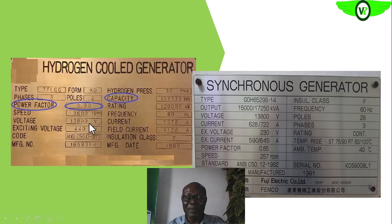You see the voltage rating, which means that the thickness of the insulation on the conductor or the type of material you use will also be looked at critically, because that will affect the amount of voltage that the material can withstand — the breakdown voltage. So we must not use the wrong material when executing this job.